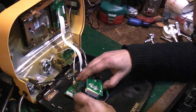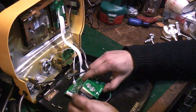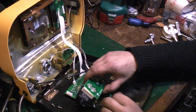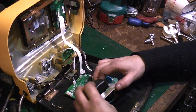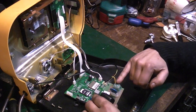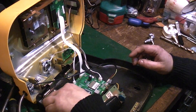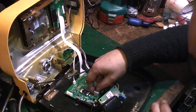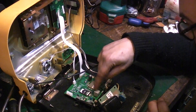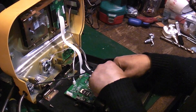I'm guessing it's designed to work from probably 100 volts up to 250 volts — it's a switching power supply producing 4.6 volts at one amp. They've literally used a US-style wall wart and just soldered the pins to the PCB, then run the mains in that way. It'll work, but I've never come across anything quite that dodgy before. There's also what looks like an RJ11 or RJ45 connection on that main circuit board.